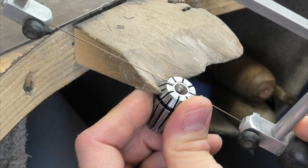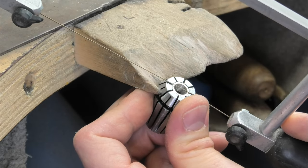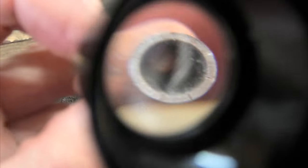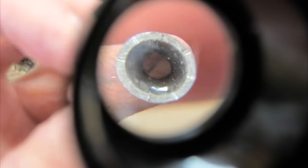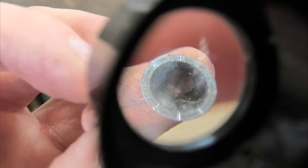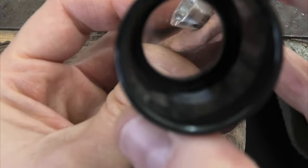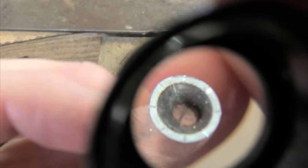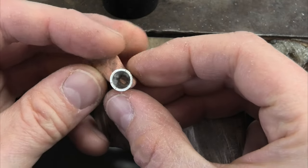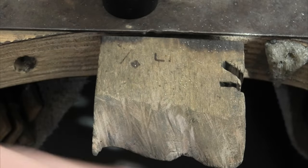You're sometimes trying to make something look symmetrical but working with bits of metal where all the thicknesses are different all the way around. Okay, let's take that out and have a look. I said I didn't like it, but you know what — that was first attempt, minimum effort — it's really good! Because the gaps were quite thick I just put my saw blade in the middle of each gap and went around it without really judging one marker against the other. That's actually really good. Might not be perfect, but wow, what a fast way to get your claws marked out. Let's try a sixer.